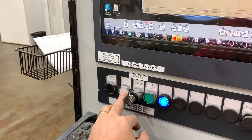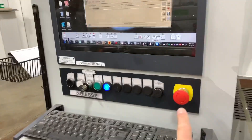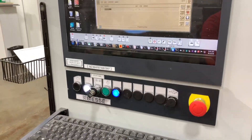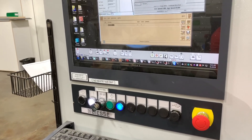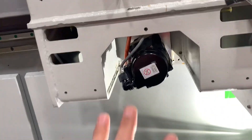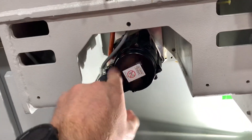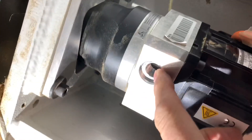Once we've got it where we want it, we restore control power: clear the E-stop, hit power, then stop, reset, and clear again. Now the motor is locked and won't turn, so we can reinstall it and have it stay in place. With control power on so the motor doesn't turn, we reinsert the motor and tighten down the motor bolts.